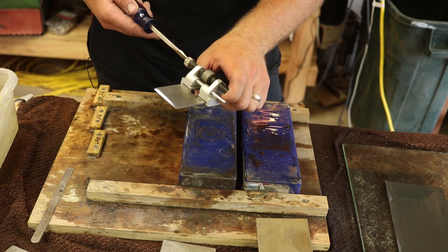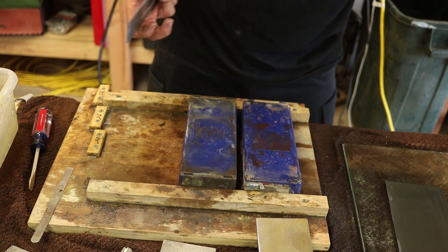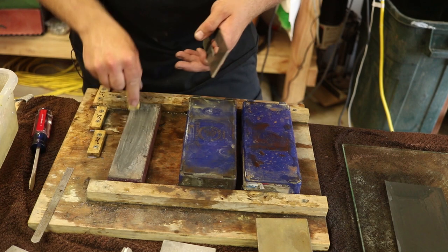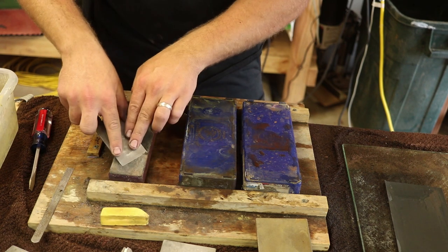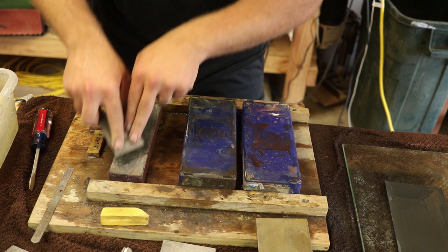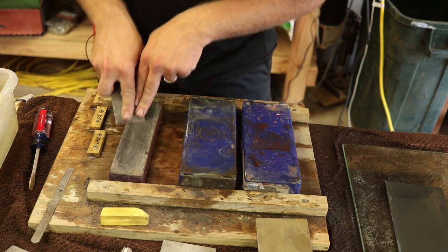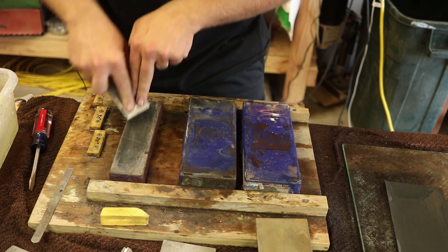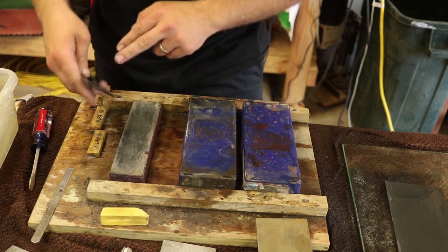Now the final step for this blade would be to strop it, which I do on all my tools. Some people might not think it's necessary but I always do it. You can make a strop yourself — a leather strap is incredibly easy to make. Just some polishing compound — you don't need the guide anymore. Find where your bevel is and just start pulling backwards on it. Every so often apply pressure on those corners. Maybe 20, 30, 40 strokes. Then go to the backside because you'll have a little burr there and start working that burr off.